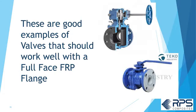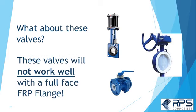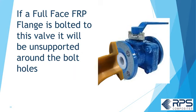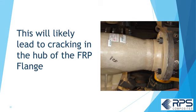Here are some examples of valves that work well with full face FRP flanges. Note the linings go right to the OD of the valve. What about these valves? These valves won't work well with a full face FRP flange. If a full face FRP flange is bolted to this valve, it's going to be unsupported around the bolt holes. And when the flange is torqued up, it's going to want to bend into those unsupported areas. And that will likely lead to cracking of the FRP flange hub.